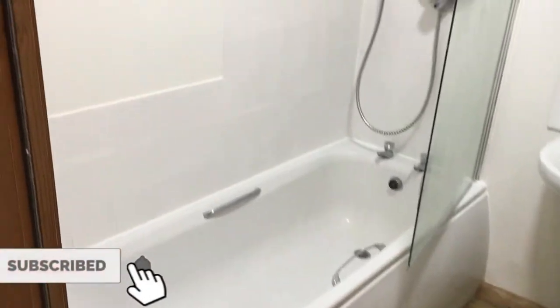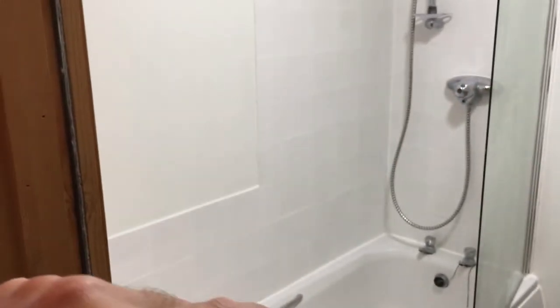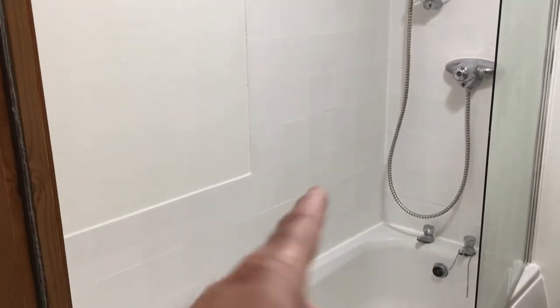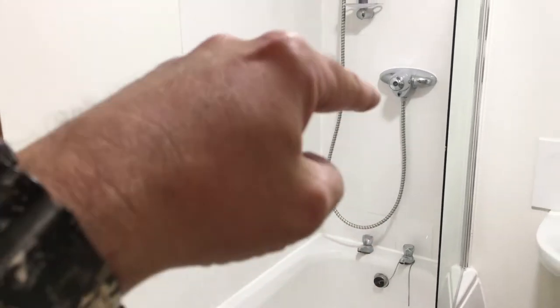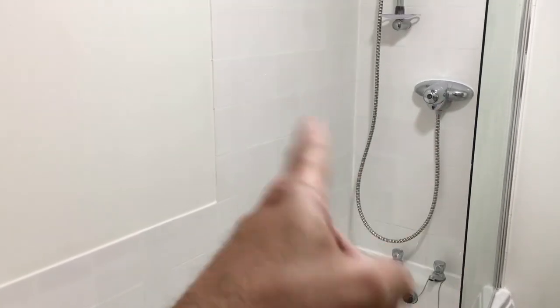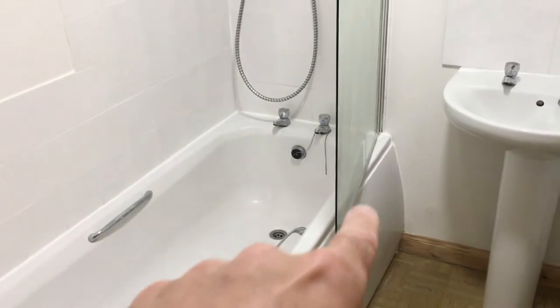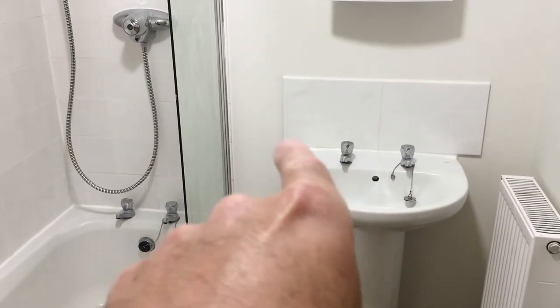There was a lot of preparation on this property - probably spent about a whole day doing all the prep. Now the bathroom - there's a fair bit of work in here with the tiles. I've done another video on this but it's basically about re-grouting the tiles and resealing the bath. There were a few tiles loose here, kicked off the wall because of a leak behind the shower fitting. I've put a bead of silicone around that now to hopefully stop the leak. This wall was all rotten down here so I've patched that, sorted the skirting board, re-grouted, and re-sealed the sink.